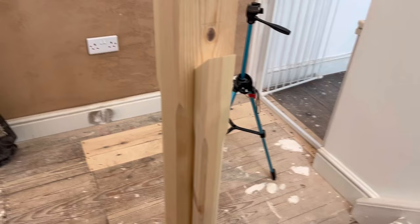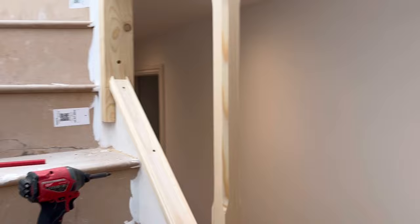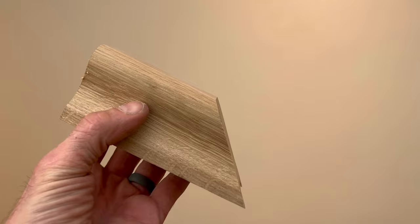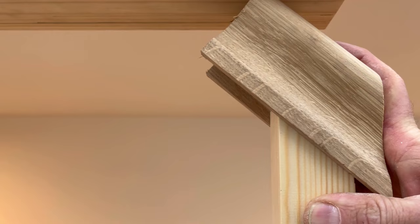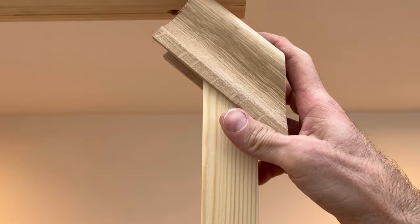I've cut my spindles using the mark on the off-cut. I'm putting the handrail on top, with the plumb cut - or seat cut - on top like that. That's not as tight as the others but it's on top. I can then plumb that, give myself a termination line up there, cut the opposite seat cut, and find the exact length. I'll leave it 5mm big to make sure I'm right. Let's try that method.